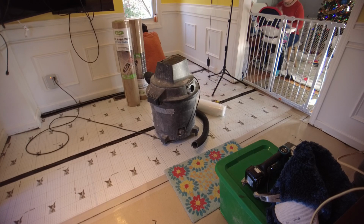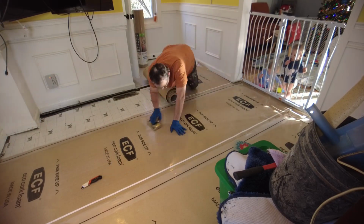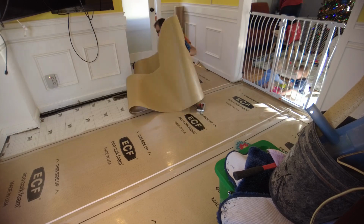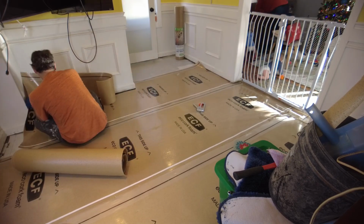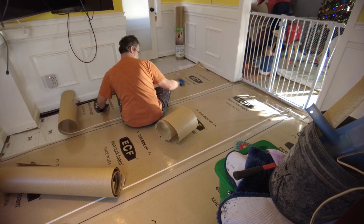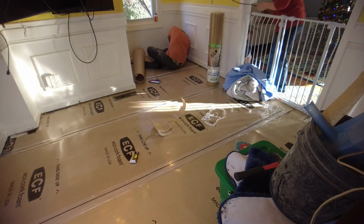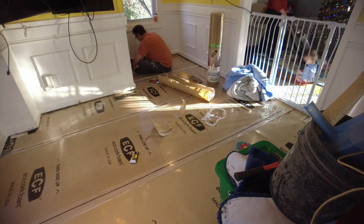So I'm moving on with the first underlayment, and I can't say enough about this stuff either. It's also a good product, this ECF, I think it's Eco Cork Foam, is what it's called. It really is a good product. But anyway, I'm moving on with it, and if you look in this back corner where I'm working, this is a good 2 inches lower than where the roll is laying right now. So I'm going to have to make up some kind of difference here and raise that corner a little bit, to bring this floor to where it will lay and look correct.